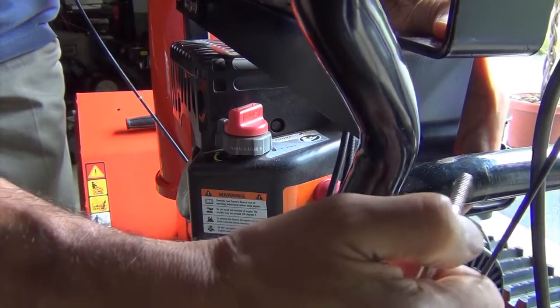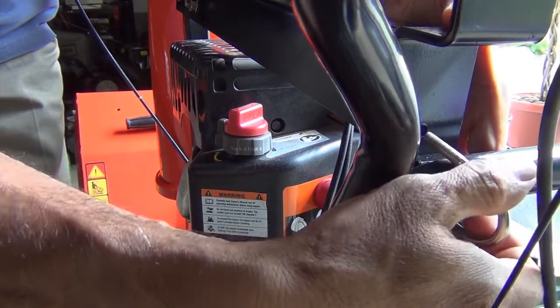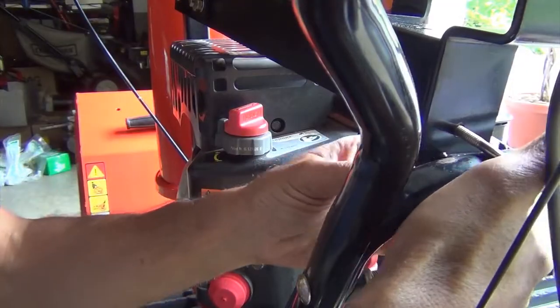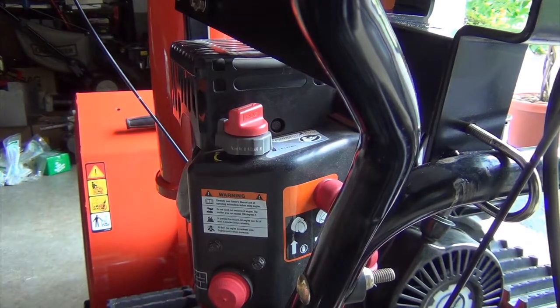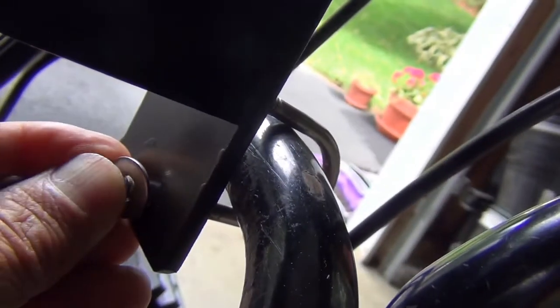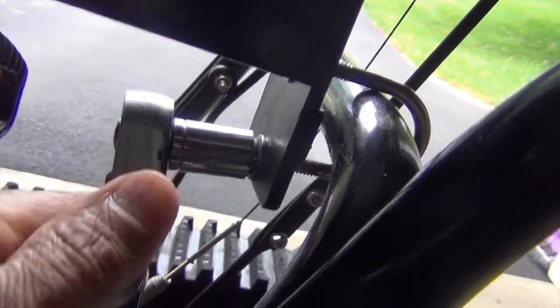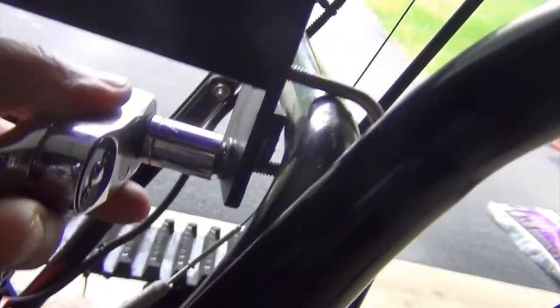Next, insert a U-bolt on the handle. Insert the two ends so it goes in by 1/4 inch. On the other side, insert a flat washer. Then insert the lock washer. Then insert the nut. Tighten this fastener using the 7/16 inch socket. Make sure the back of the slider assembly is butting against the handle and tighten the U-bolt fasteners.